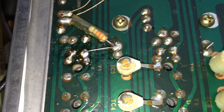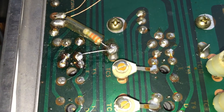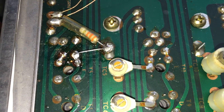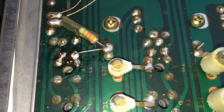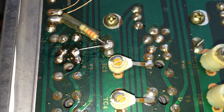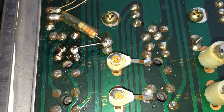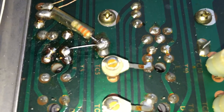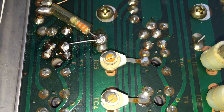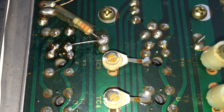So although I replaced the capacitor C2 and it seemed to work fine, it apparently was not okay because I saw diminished sensitivity over the course of about a day or so while I was listening to this. I think re-soldering in the new cap temporarily mitigated the bad connection, but it gradually started to fail again. So I simply ran the lead — instead of snipping the lead off — over to that ground connection, and it seems to have improved it. I'm now getting even better sensitivity than after I first fixed it.